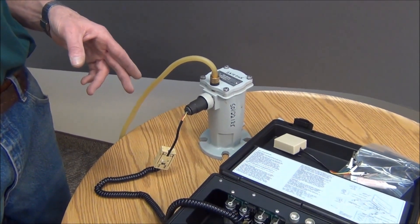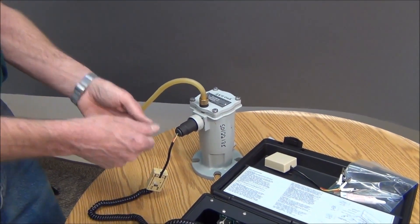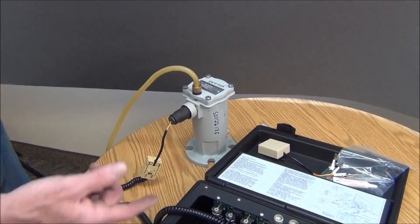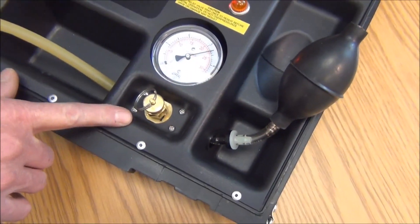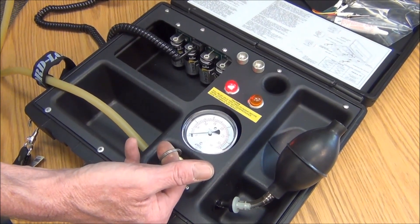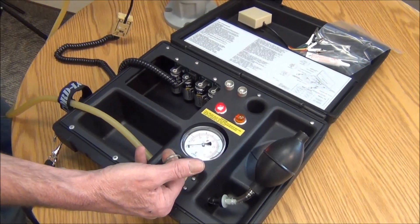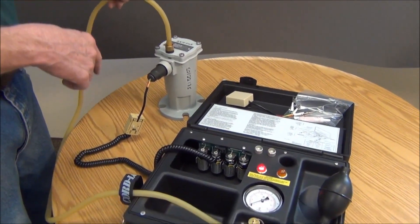What we're doing with this test kit is simulating a pressure increase in the bottom by pressurizing the top, and then we're going to pull a valve to let the pressure escape out of the top really quickly, simulating a sudden increase in pressure in a tank. The timer has done its thing and reset, so we're back to the red light. The next thing is to pull a small SPRV to let the air escape — make sure this hose doesn't get kinked anywhere. I'm going to pull this pressure relief valve open and hold it up. The light turned yellow, which means the unit tripped. This simulates roughly a 5 PSI per second increase for about half a second, and the unit tripped, which is what it's supposed to do. This is a good unit — that's the pass test.